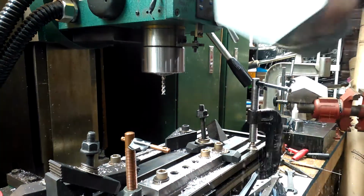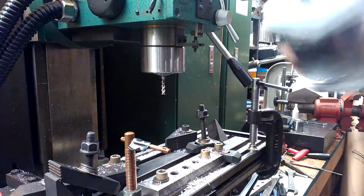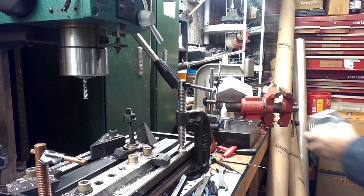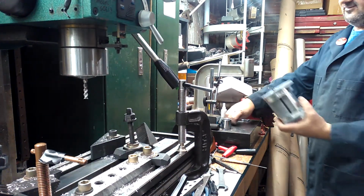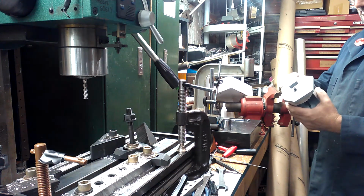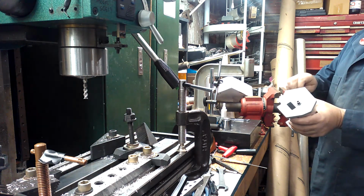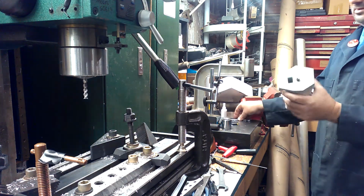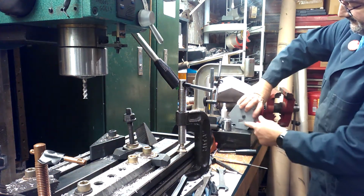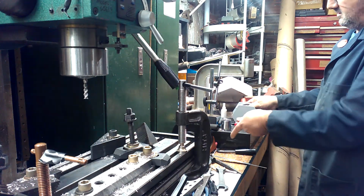So we dump out all the swarf. Yay! Machining loves sprinkles. Okay. Can you see over here? All right, yeah, you can. Oh, first thing, undo the set screws. It is very easy to forget, but you're going to sit there and try to force it back apart, and it's not going to want to come apart, and you could end up breaking the fixture. Go here, here.